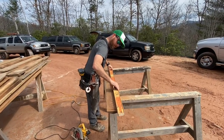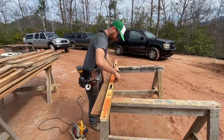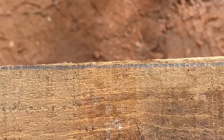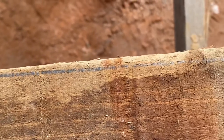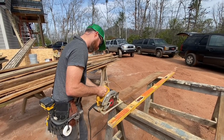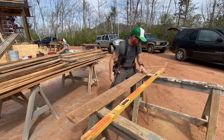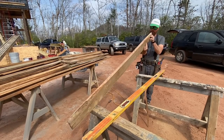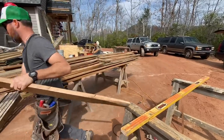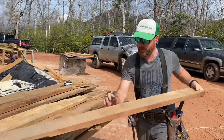Once we had the material on site it was time to process it and make it actually usable. To get one straight edge on the boards I used my six-foot level as a straight edge and made a pencil line, then carefully cut the line with a skill saw. This process is called straight ripping. You could also use a track saw or clamp a straight edge to run your saw base against for an even better result. I visually sighted each board — some had an edge good enough not to require the straight rip, and I marked those with an X.